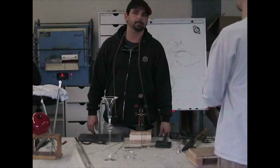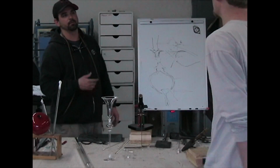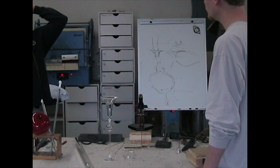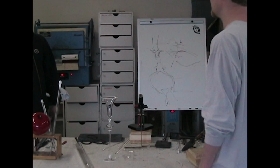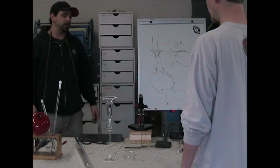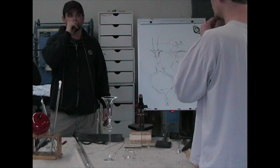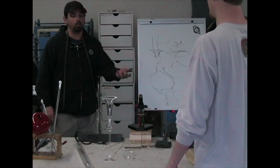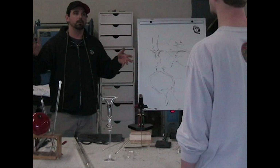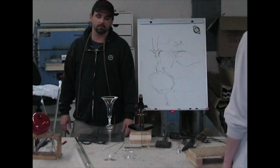Is that how you do all your pieces, or do you have different annealing processes? Most all pieces, because they're about the same. And even with the figure and stuff, you can make sure that everything gets to 1025, and I'd say no more than 10-15 minutes of holding it there with most things, and as long as you bring it down from there. Do you bring it all the way down? I let my controller ramp from annealing to 700 over 3 hours. And then it shuts off and comes down.